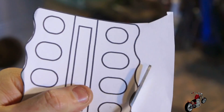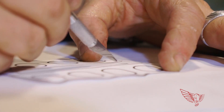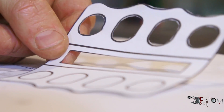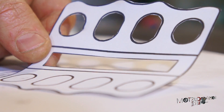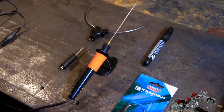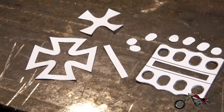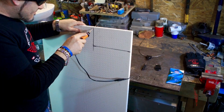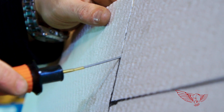While I wait for the wire to heat up, I transfer the paper shape onto the board. For cutting the paper I suggest using an exacto knife with a long blade — it makes following the line much easier than scissors, and the inside holes are a breeze. The cutter comes with different attachments and I test the long tip to cut out the portion of board for the two designs. This board is pretty dense compared to packing polystyrene, but it cuts very well.